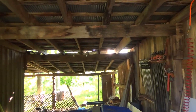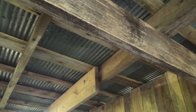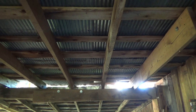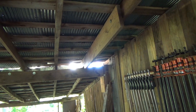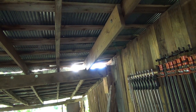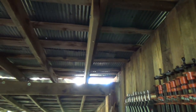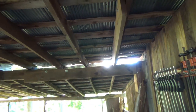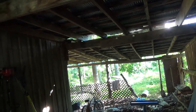Of course, in the process of doing all this stuff, I have a rafter up here that needs to be replaced. They got one thing bolted into it. It's all rotted on the end, which is why they did it. And this beam going across here is rotted, and that's why they got that piece bolted in part way across. The back lean-to part is all coming off. So I'll probably put up another beam on this side of that one, and once I have it up in place and have this one bad rafter sistered in there, I can't take it out. Well, I suppose I could take it out, but I'm not going to try to. I'm just going to put another one right in beside it all the way down, and that'll take care of that. And then eventually I will probably close the back of this part of the shop off too.